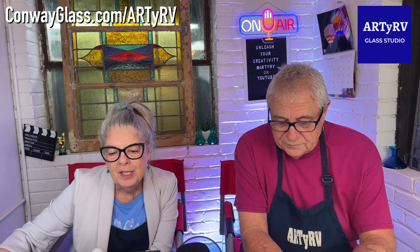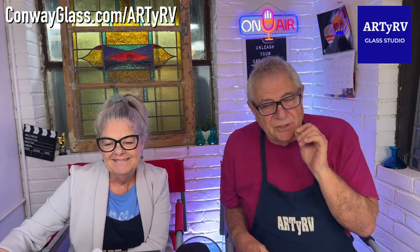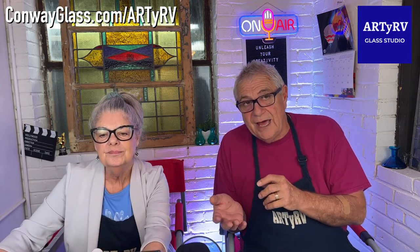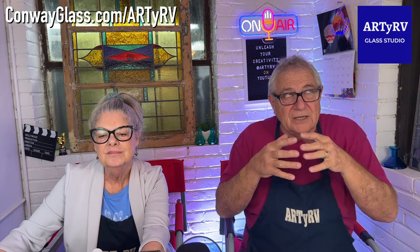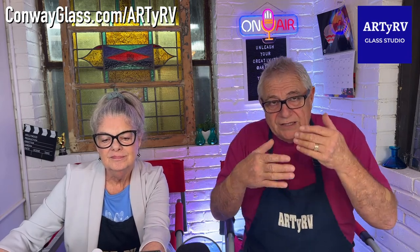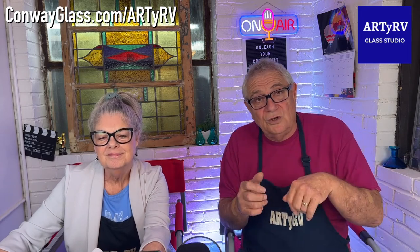Let's see. Magali wants to place a stained glass into an old antique window. When buying an antique window, what should she look for and be aware of? Typically, Magali, on those older windows, on the sashes, you need to look in the corners, because a lot of them are rickety and a lot of them are rotten. If they're just loose, because most of them are not finger jointed, there's a joint that goes inside of each other like this. And if they come apart, that's okay, because you can glue them, put them back together, have your husband clamp them and screw them together, and you're good to go.